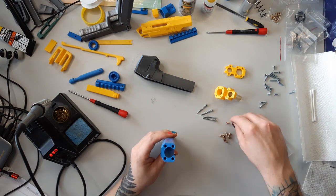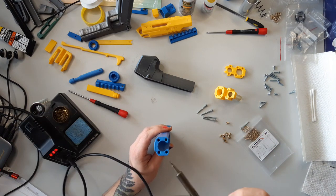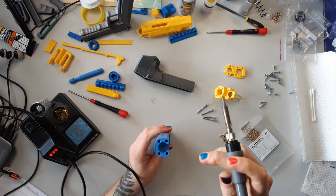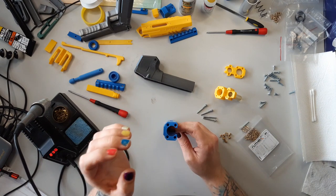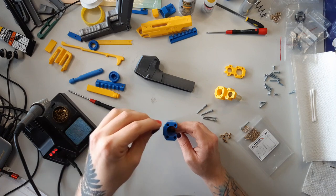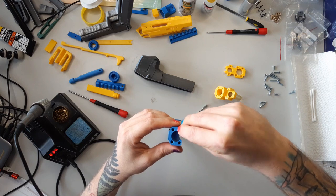And a way to do this, by the way, when the heat insert's in there, is by just putting the tip in there and then just slightly lean it to the side where you need to tilt it to. Don't do too much heat, in the sense where you have it corrected a little bit, and if it's not enough, do it again, but don't have it in there for too long and do too much, because you will melt too much material. So one.